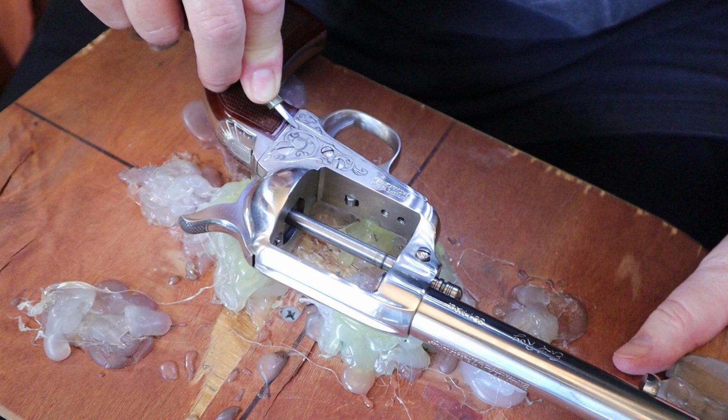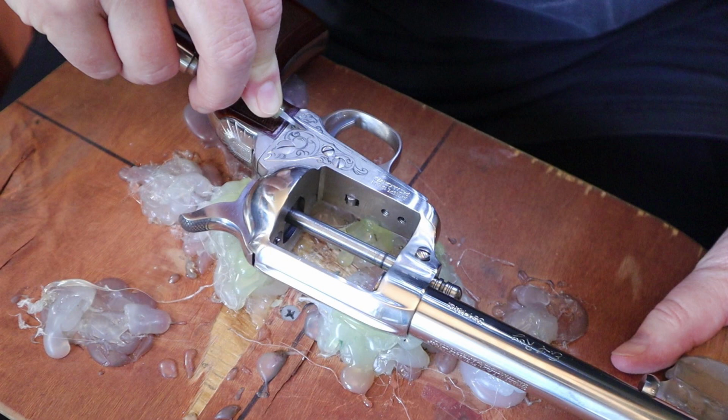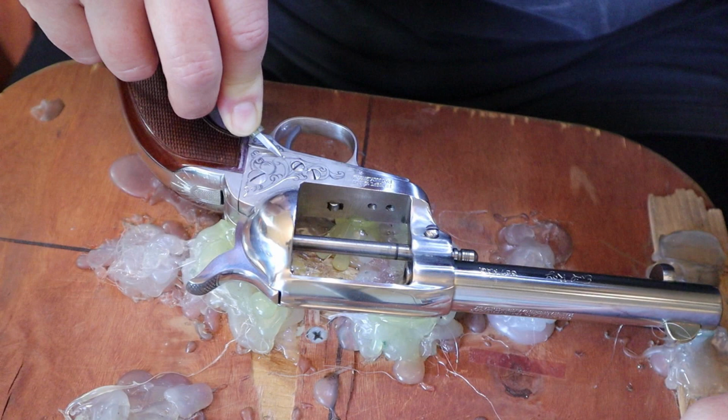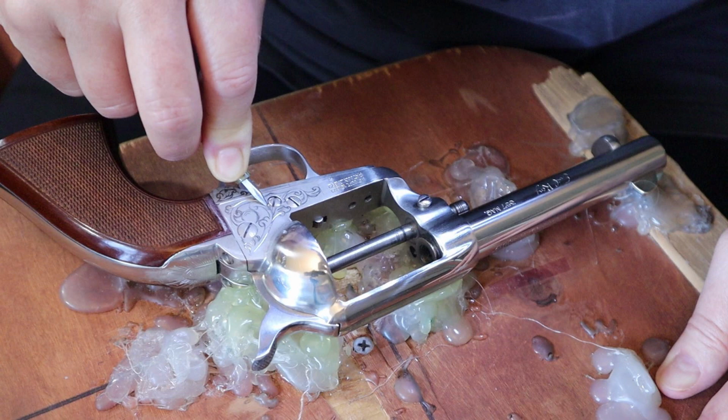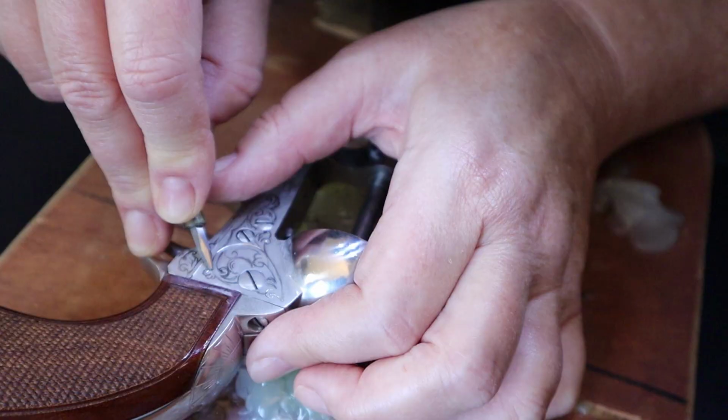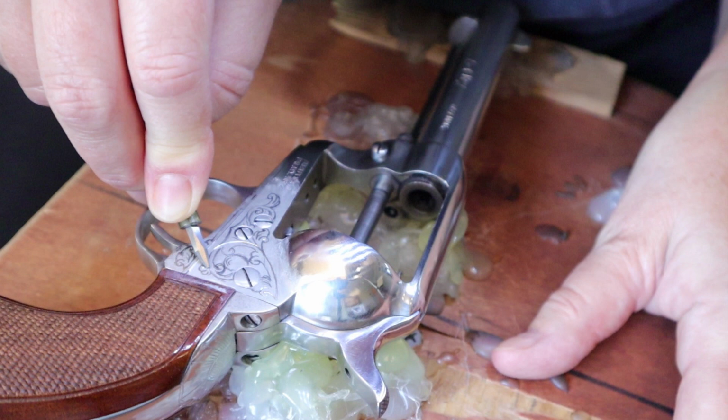So there's a lot going on here, more than meets the eye. I'm not just simply cutting. I'm also using my foot to gauge the speed of the hammer that's inside of the graver. That's done through air, and so I'm pressing down with my foot. You can hear whenever it revs up and starts going. That's me pushing on the gas to get the hammer going in the graver. So I have to adjust the speed of the hammer with my foot.